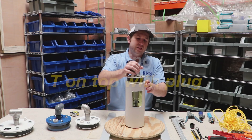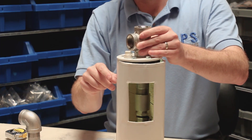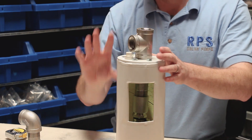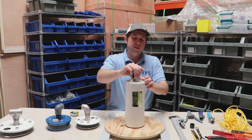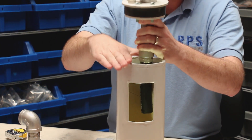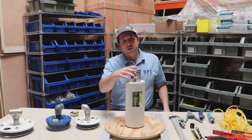This whole assembly sits down on top of our well casing and the lip pushes against the well casing. It takes the entire load from your pipe, your well pump, your wire — everything else — and reacts it against the top plate. The lip of the T is pushing against the top plate, which pushes against the top of the well, and that holds everything in place.